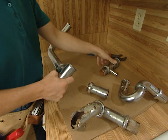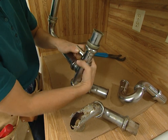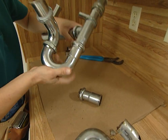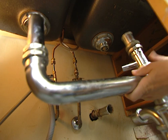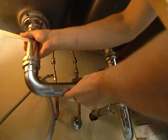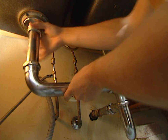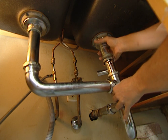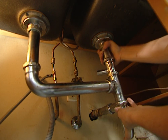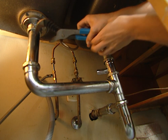I need to remove this piece so that I can add a tail piece for our dishwasher drain — and this is where it's going to hook up. And if you'll remember the old P-trap, look how bad that is. So I do have a new P-trap to put on. Our drain pipe can go back in place — let me line these up. Now I can tighten up this nut, and you want to remember to leave your drain pipe facing towards the dishwasher hose. Use your channel locks to tighten all this back up.